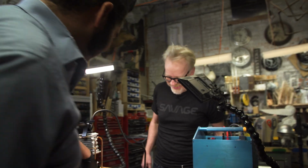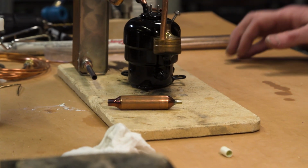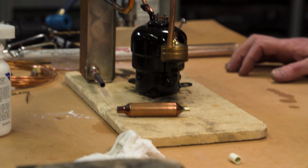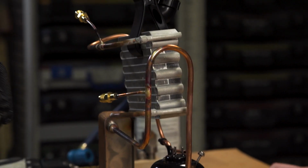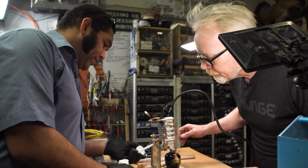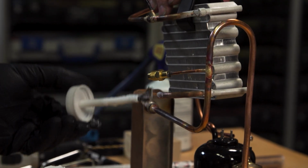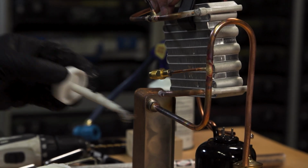It is still hot, and we just dunk it in a glass of water, right? Exactly. Get all that water right back in there. Is it hygroscopic? Will it pull water back in as it cools? Yeah. Okay, so we want to get it up quickly. So we'll hook it up while we're still pretty warm, and I'm doing all the brazing with the high silver content material just because we can, and it'll look pretty once it's all cleaned up.